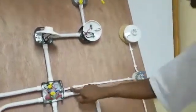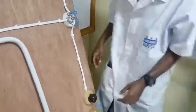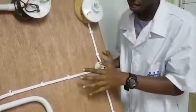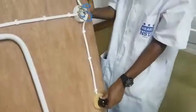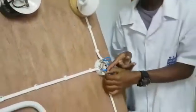Now we're going to move on to the surface wiring, which uses a 1.5mm square twin and earth sheathed cable. Here you have our switch 4, which is the surface switch controlling lamp 3, which is the surface lamp. We have our brown wire here, which is the live.